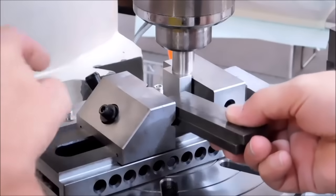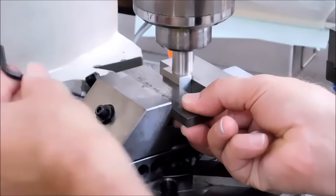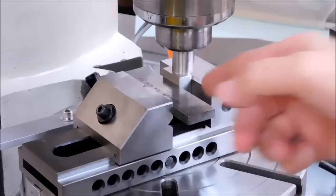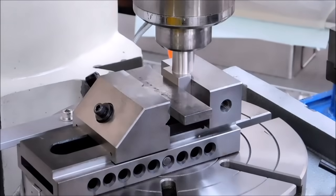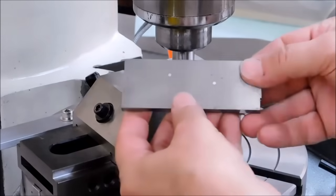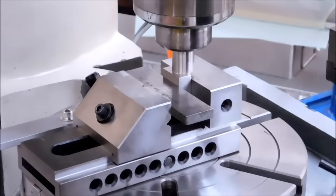Now I'm going to squeeze the pin — I'm just going to use a couple of random parallels. I know that this reference surface here is three-quarters of an inch in from the rotation point on the table. So I'm going to use an adjustable parallel against my hard stop and I'm going to orient the vise itself. Adjustable parallels: squeeze them, they get taller; unlock them, they get shorter. It is now parallel with the back.